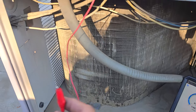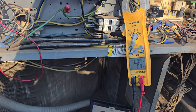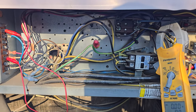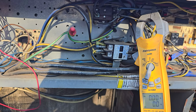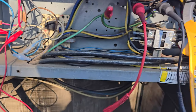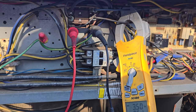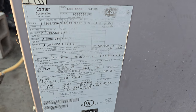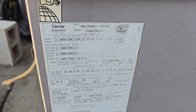This should be the indoor blower motor — you notice we have a dirty condenser too. It's not clicking. Should have started jumped out. Let's check voltage at the indoor blower motor contactor to see if we have 24 volts. There was no power at first, I had to connect it to the wire. Indoor blower motor's running at 3.4 amps — it doesn't seem bad. We have 24 volts at the indoor blower motor contactor. The unit is allowed to run 5.8 amps for the indoor motor and the compressor's RLA is 17.3 amps.